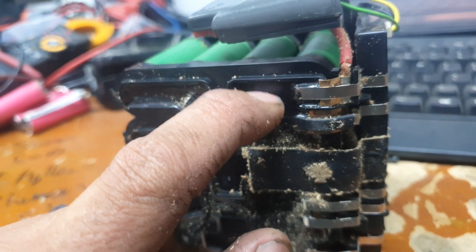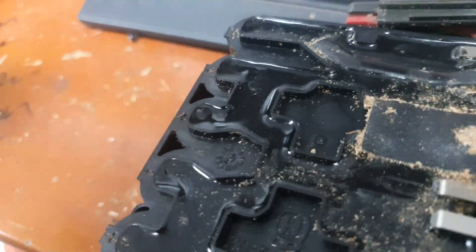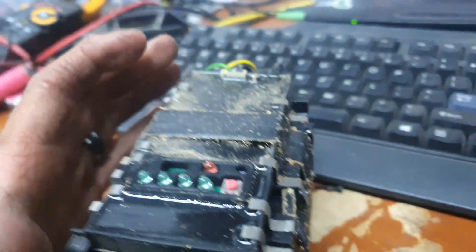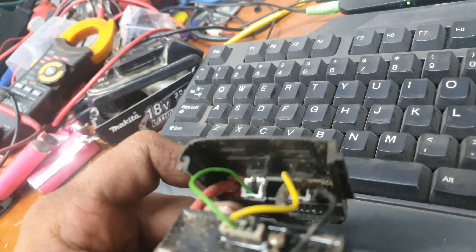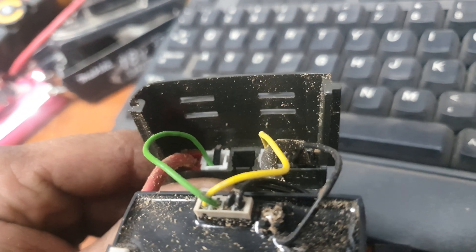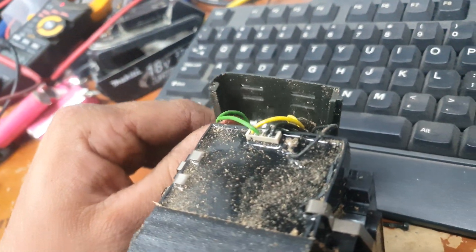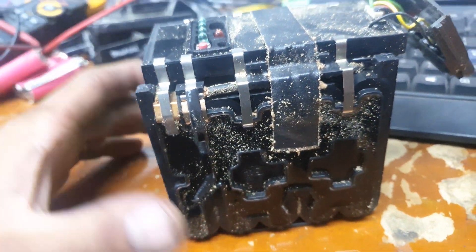The insulation is reasonably good — it's all potted, like conformal coating. It's even got the Husqvarna symbol in the middle. Good coating overall. Evidently there's a BMS failure which has caused our problems. There are also two wires in there that have been cut off — and there are two pins in the center that aren't going anywhere. It's a bit strange. Obviously in this coating is the battery management system.